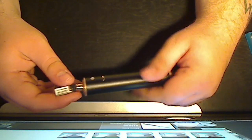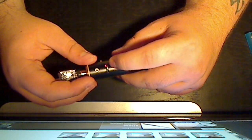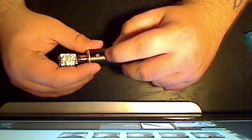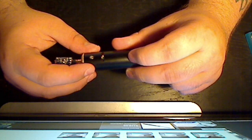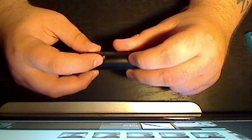I'm going to flip this light back on, guys. And it's really easy. All the way down is at a little over 3 volts. All the way up is over 5. Now, there are little notches cut out, so if you go all the way down, right by the green notch in here, I don't know if you can see that, there's a little green notch. That's at the lowest, and that's at like 3 something.